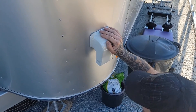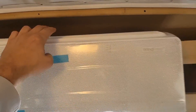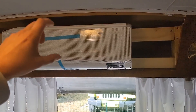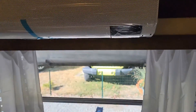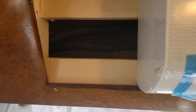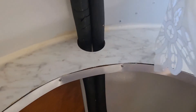That will give us room for the air to pull through the return. The air returns right there — that's our hole cover. Progress update: the wall mount air handler is mounted. We need four inches above, and this is what we're going to get — about three inches, so it should be fine. We wanted to make sure we get as much clearance from the ceiling to the top of this air handler for plenty of airflow. If you don't have enough return, you won't have enough supply. This is where the air is sucked in, this is the supply vent. We've got some two-by-four framing here and it is pretty sturdy. We have the drain right here, and then our liquid and vapor line.